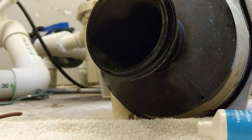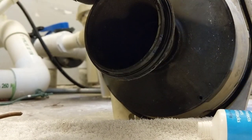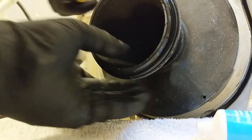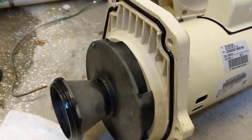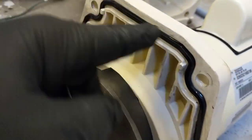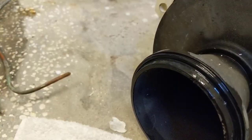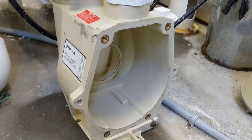There's the 3/32. Okay, so we got the motor mounted to the seal plate, new shaft seal on the inside, new seal for the seal plate to the pump, and then we have the new seal here for the impeller. So now we've just got to mount all this back to the pump.